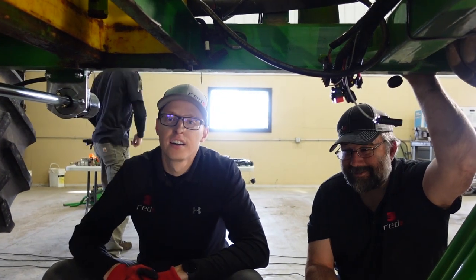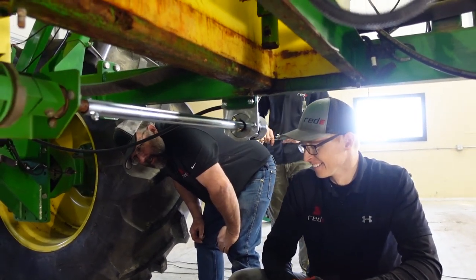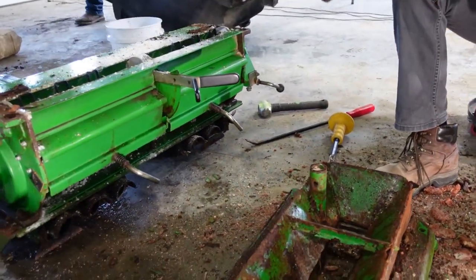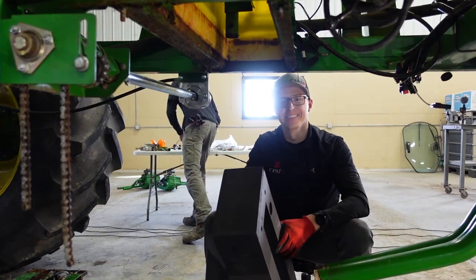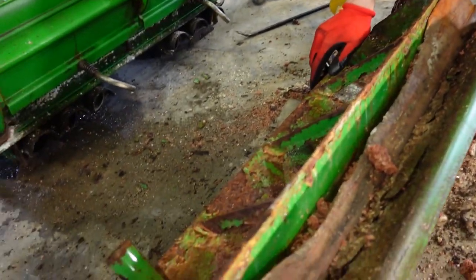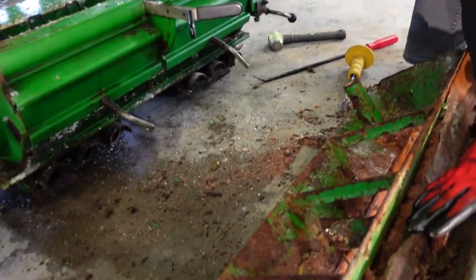That makes sense because I was pretty frustrated by not being able to find the issue, and I didn't really have the motivation or the tools to be pulling the entire meter off in the field, right when you want to be going in the middle of trying to hurry before the weather comes down. So this is what that seal is supposed to look like — right there where the upper edge is completely missing. And this steel piece here that's been rotting out — we have the option to throw in a stainless one. It's nice of you guys to have brought that option. It's potash, petrified potash. How does it get in there? I suppose it's not a tight seal between the tank and the steel, so it just kind of dribbles down in there and fills up — the dust or the granulars get in there and eventually eat away the seal. Sits there and rots things away.